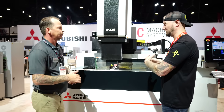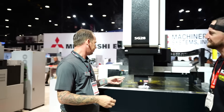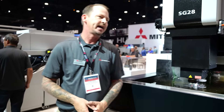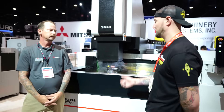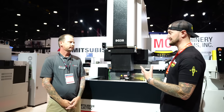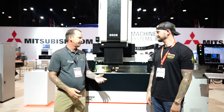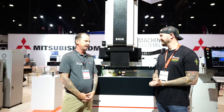Do you see a lot of guys doing that — putting the electrode on the table? Well, depending on the application, because you can make a bunch of fixtures and hold small parts, and you can put those parts inside your tool changer, which makes it easier to automate. You can get many uses out of electrodes like this. One of the biggest advantages of any kind of EDM, whether it's wire or sinker — to me it's always been the original lights-out machining. They're not always the fastest way, but my favorite thing was to set up the wire machine at the end of the day, let it run overnight, come back in the morning. Same thing with sinker EDM — set it up, get all your electrodes done, and let it run overnight while you're not there.